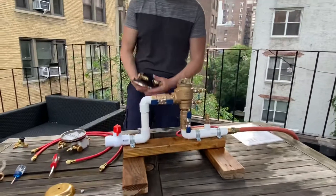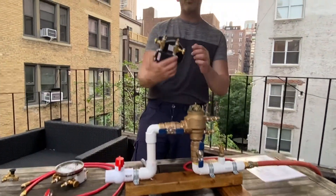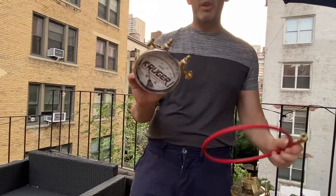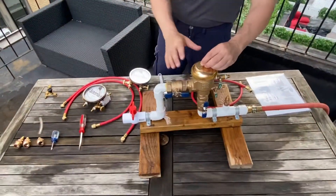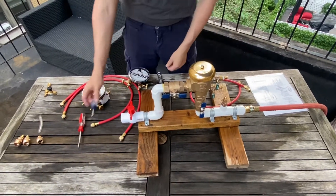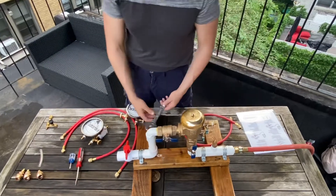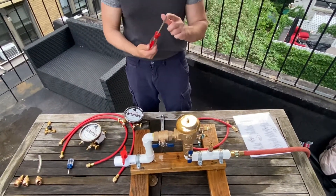For this test, we're going to use the Kruger Instruments TK2. It's a two-valve test kit with one hose, and that's pretty much all you need. Depending on what kind of canopy you have, you'll probably need a Phillips screwdriver or crescent wrench to open it up in the field. Depending on what kind of test cocks you have, you'll probably need a flathead screwdriver.